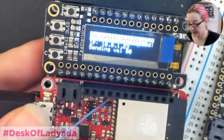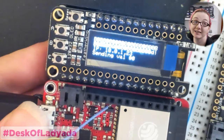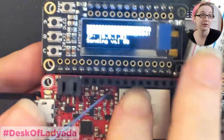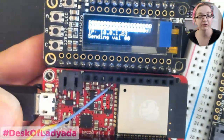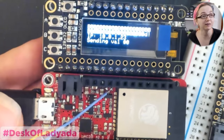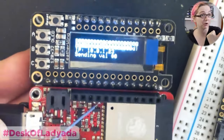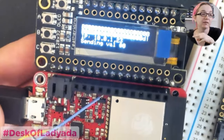I could, but the OLED Featherwing is well into mass production, and we've made a lot. One of the things I was doing as I was designing this is learning what doesn't work. I'd actually rather change around the pins on the ESP32 Feather because it doesn't matter. Nobody cares which pins are where on the GPIO pins up here. So what I did is when I revised it, I just shifted it around so the two pins that needed to have the internal pull-up capability were ones that could do it. Until maybe we figure out why I can't seem to turn them on. Because the datasheet seems to imply that all pins have internal pull-up capability. So it could be also something with the API, not necessarily hardware. But since I was rearranging stuff anyways, it turned out it was quite simple to just make those two pins be ones that I could verify worked with pull-ups.